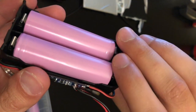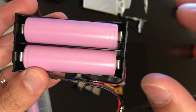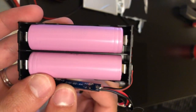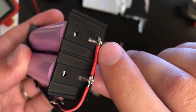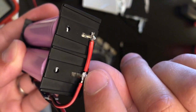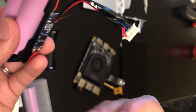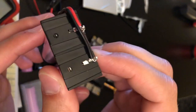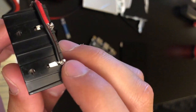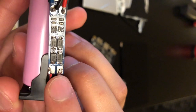So let's go over how to wire this up. The two batteries are in series, so you're going to have a midpoint which the PCB requires you to connect to. For this battery pack, I've got my midpoint up here and I've soldered a jumper wire from one end of the terminal to the other. From that terminal, I've routed it down to the PCB's BM point — the battery midpoint. On the other end, we've got the positive and negative terminals for the 2S pack, which are soldered to the corresponding PCB contact points.